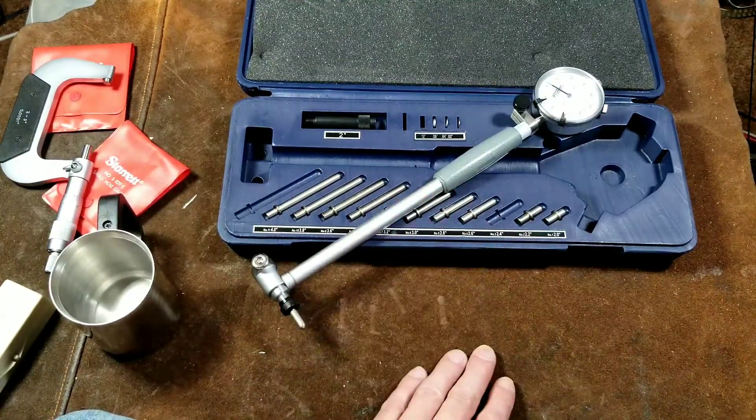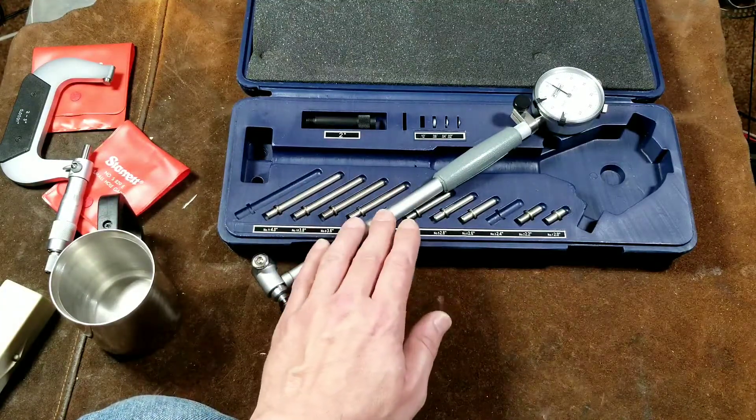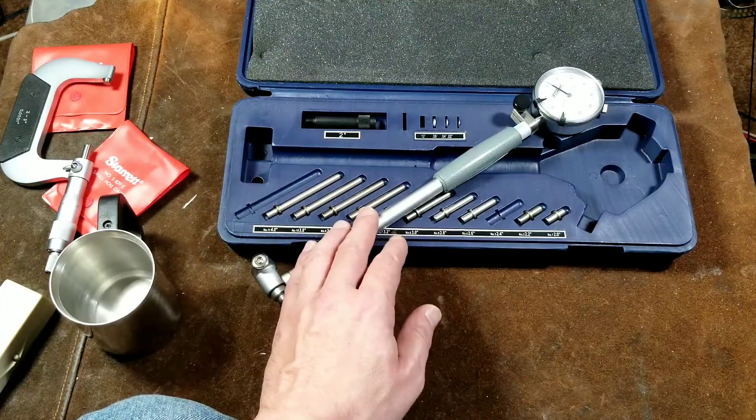And trying to use internal mics or telescoping gauges when you need to take several measurements — nothing beats one of these. I just took 20 or 30 measurements in the amount of time it would have taken me to do two or three using just about any other method. There's a lot of mechanics and service people who watch my channel, and I just wanted to show how effective one of these gauges is, especially if you have to do any kind of repetitive measurements. You really don't want to mess around with spending so much time counting Vernier scales — you just want a good measurement, have good confidence that it's accurate, and be able to take repeated measurements just to make sure you really got a good baseline. I really appreciate everybody watching. Please subscribe. Cadis Maximus out.